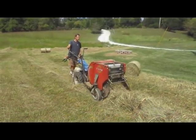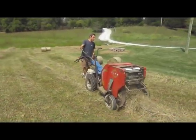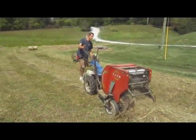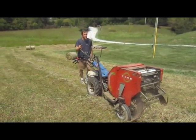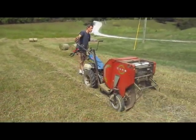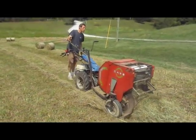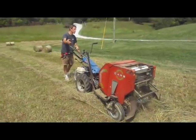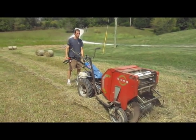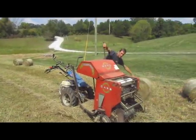Next, we get into the hay baler — arguably one of the most amazing tools that goes on one of these walk-behind tractors. People can't quite believe you can run a baler with a small piece of equipment like this, but here it is. It makes a 40 to 60 pound round bale of hay in about a minute. The bale is formed in the bale chamber by a series of aluminum chain-driven rollers that roll the hay around the inside of the chamber, compressing it into the proper shape, and then a net wrap is applied to the outside of the bale to bind it together. The net wrap is adjustable in three different amounts depending on the type of hay and material being baled.